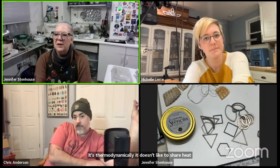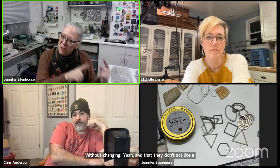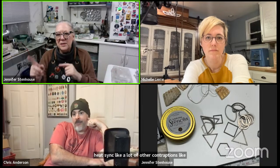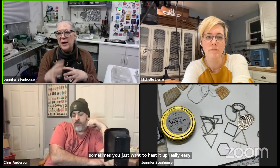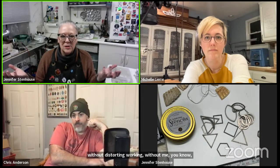Yeah. One of the things I know about working with it when it comes to the baskets and using the titanium basket jigs, they have been brilliant for putting together shapes and forms and constructions, holding the tension without changing. And they don't act like a heat sink like a lot of other contraptions like tweezers and things will do, which can be a benefit sometimes as well. But sometimes you just want to heat it up really evenly. And I noticed that the titanium allows you to do that without distorting, warping, without any weirdness going on. And you can pick it all up and quench it all, and it's all fine afterwards.